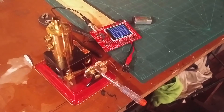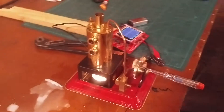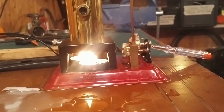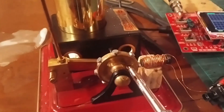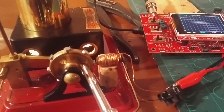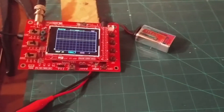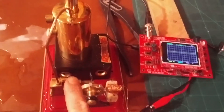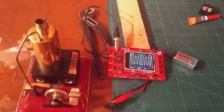After a while of fooling around I got it running. I had to modify the candles a bit — put more strings inside so they produce more flame — and it's really getting to pressure, which is neat. I glued my magnets here, made a coil myself with a lot of super glue involved, and back here I have this little oscilloscope connected to see if it gives out any AC. Oh nice — you can see the curve there on the oscilloscope!